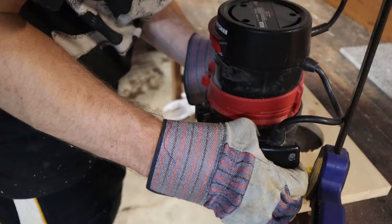After you cut the hole I also did an extra step where I smoothed out the edge using a router. What this does is basically round off the edges so you don't have any sharp corners. This is especially nice for these hole shelves because it makes it a lot easier for them to go through without a rough edge to rub against. Plus it looks very polished when you router the edges of your shelves. Once you do cut this hole, make sure that you sand the edge of the hole and the rest of the shelf as well. Each time you do another cut, make sure you sand everything you cut.